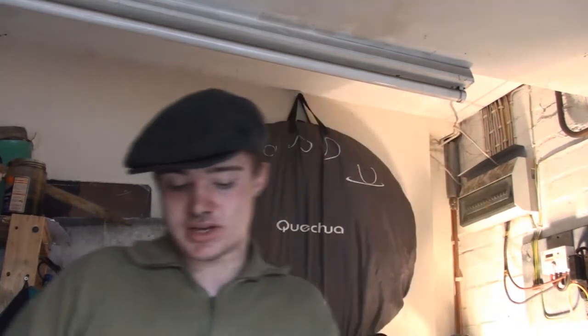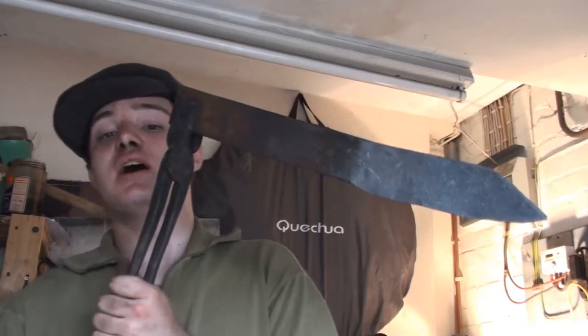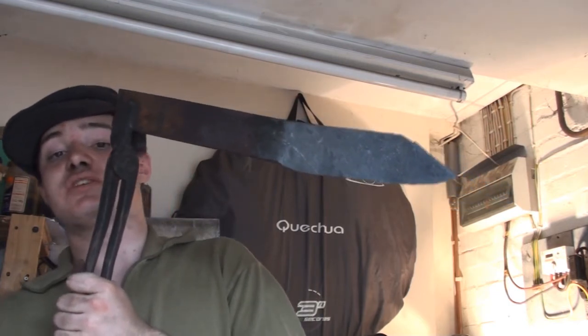So yeah, what's left is to, I've probably told you this about 5 times, draw out the tang, finish off with the bevels, finish off the facing, put the distal taper on, and then do the handles. So still most of it left to do, but you know, we made a start. So hopefully we'll avoid grinding as much as possible.